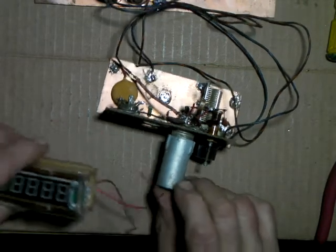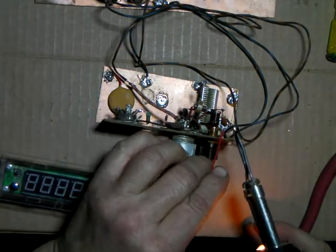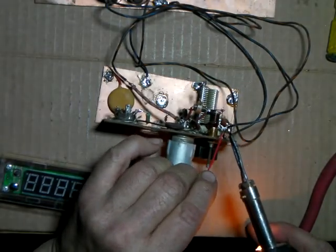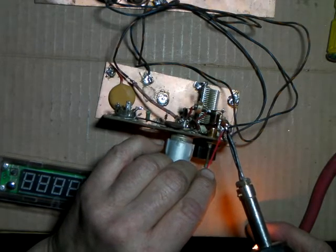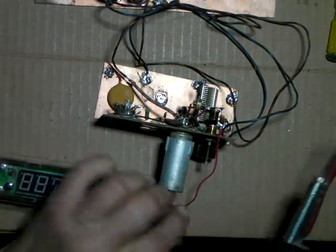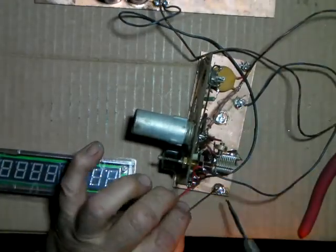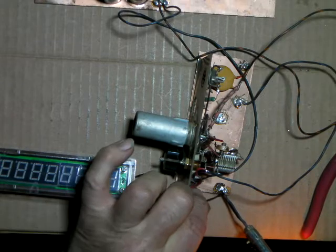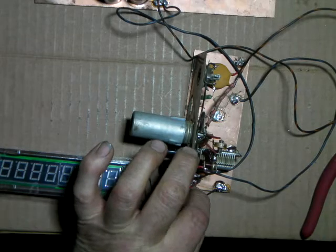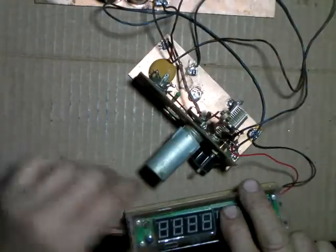We'll hook this up real quick again. I have my little sample cap already on this one because I was looking at it the night before. This is neat. 30 volts plate voltage. Don't need any high voltage. And all I did is I copied the circuit as it was out of the manual. I'll show you, there's a couple things I did need to do just to make it work. I substituted a resistor and a choke for one of the coils.